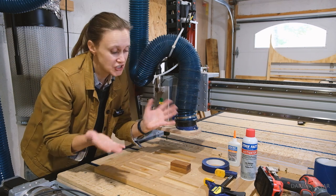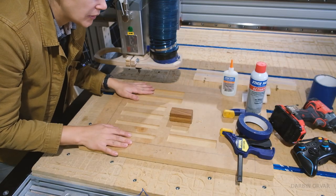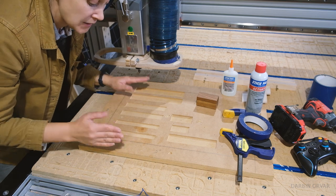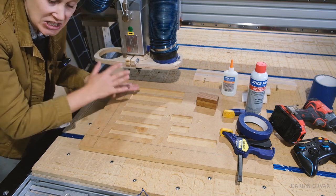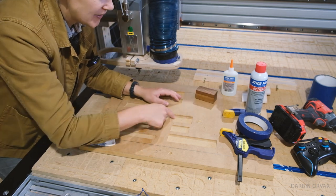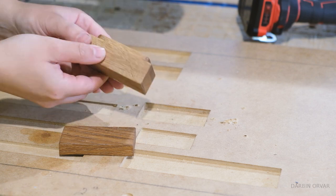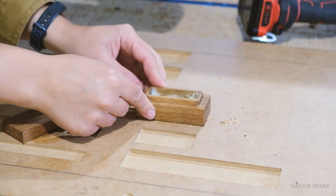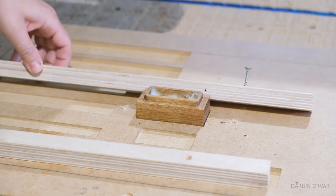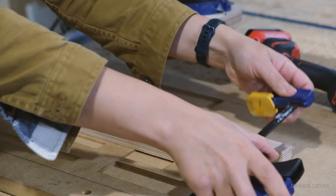So what have we created here? This is a jig. A jig is always the answer to precision. This here is an MDF board and as you can see it has various indentions cut out for different projects — I use this one for a bunch of different things. As long as you secure this in the right place and the machine knows where it is, it will know exactly where these spots are because I set them in the program. Here I have a brand new box — I cut this project in two separate sections: a thin block of wood for the lid and a thicker block for the box. Since I'm cutting over the whole thing, I need access to the entire top, so I wedge this in place and use a clamp.